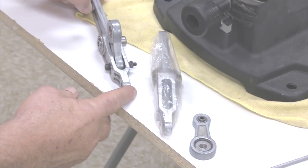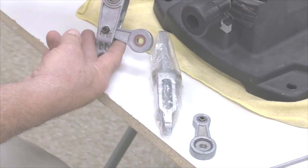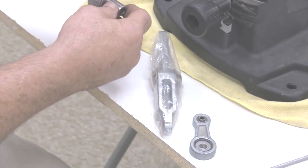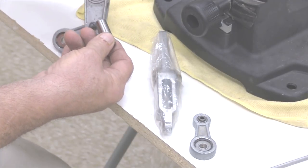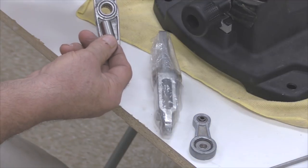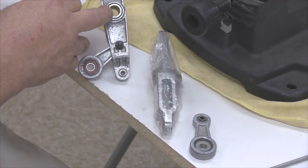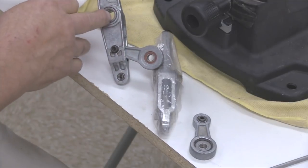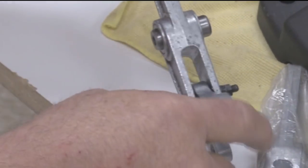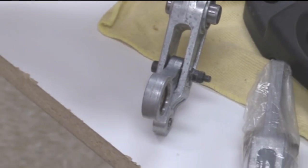We'll take a moment here to talk about the vertical rocker arm that goes in the back of the machine. This is the entire assembly. We can see a large-scale version of what a sleeve and roller bearing looks like. This is the sleeve that the vertical rocker pivots on, and the two bearings on the vertical rocker, there's one pressed in from this side, another pressed in from the other side. The sleeve goes in there like that and would go into two casting receivers in the case.